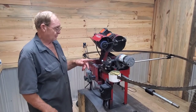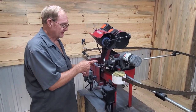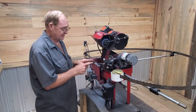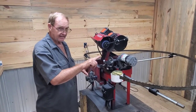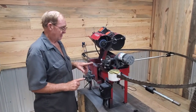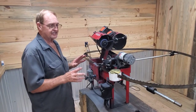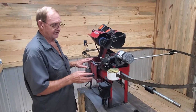The WD-40 sponge system puts a little oil on the blade and helps reduce friction as it slides through the block, because he puts a little more tension on there than most people would. Whenever that stone comes down across the face of the tooth, he wants the tooth to stay still so it cuts down the face, down the gullet, and up the tip of the tooth — doing the same thing on every single one. You don't want one tooth high here and another high somewhere else.